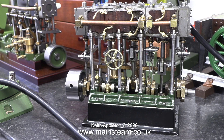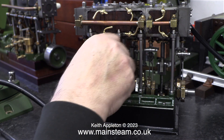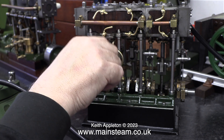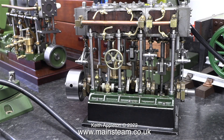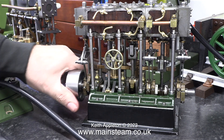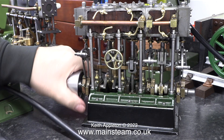The engine is beginning to run a bit smoother. The only problem is some of the parts are not fastened down properly yet — for instance the crosshead guides are only secured at the top, and I'm sure something is going to tighten up when I secure them at the bottom as well. In this part of the clip I'm rotating the hand wheel to move the valve gear to the other side to attempt to make the engine run in reverse. That is impossible — it just doesn't feel right, so I moved the hand wheel back to the other direction.